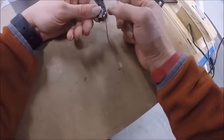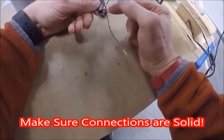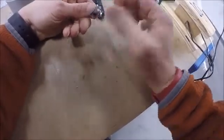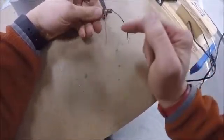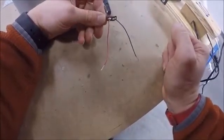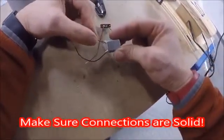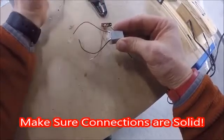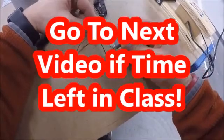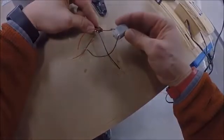When you're done, double check the connections — the wire should be nice and solid and shouldn't wiggle around inside the hole. On the switch you should see a nice gap between the two tabs — they're not soldered together. On the motor, come and double check that the wires are on there nice and solid. That's all there is to soldering these first two parts — they're getting close to being ready to go into your hovercraft.